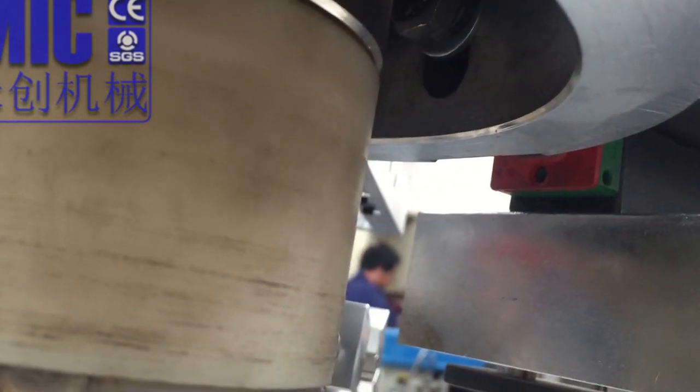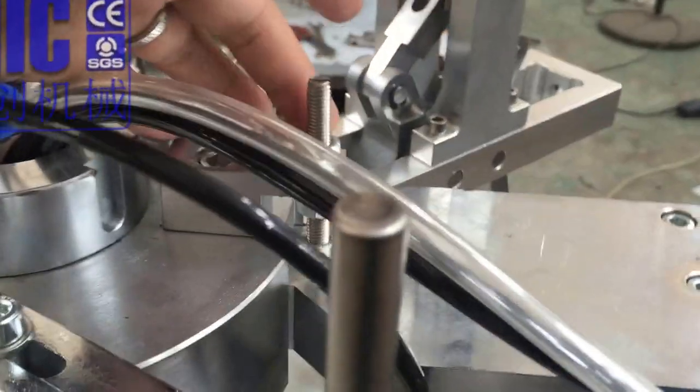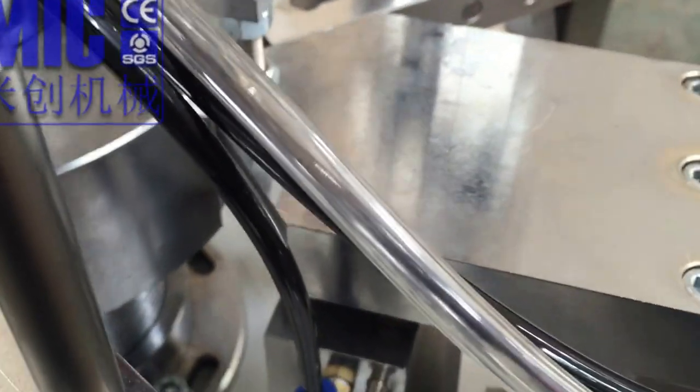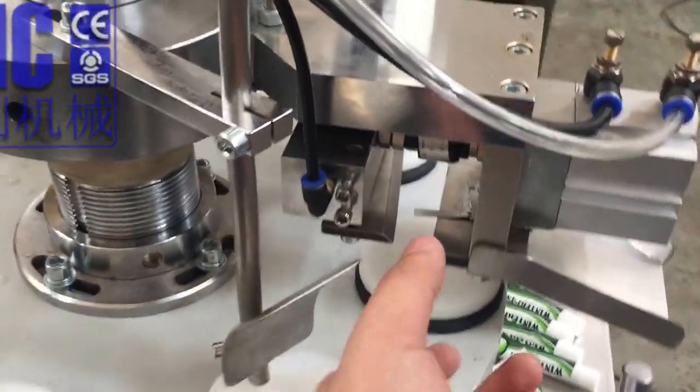Inside, there is the cutting tail height adjustment, there is a screw inside here. Okay, you loosen it, and then you make a slight change here to change the height of the cutting tail. Okay, this is for the height.